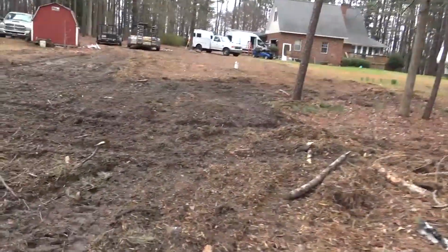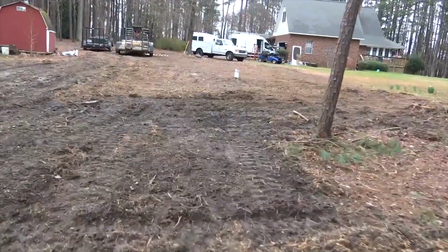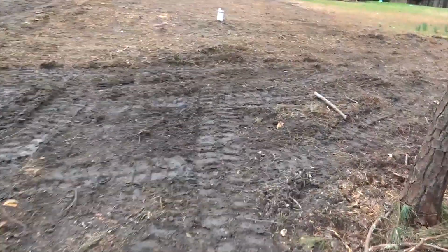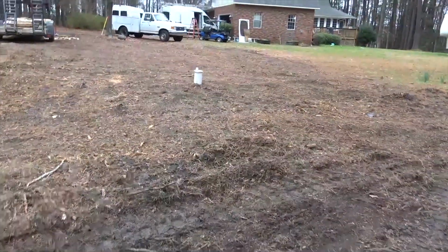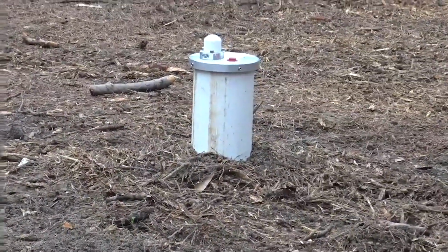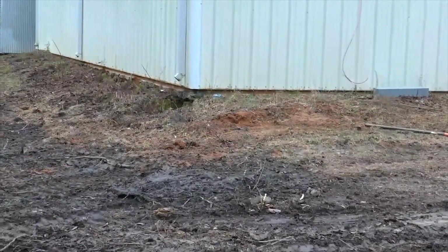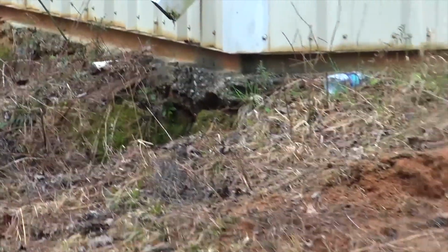Last night, I don't know if I mentioned it, the customer wanted his well fixed. Somebody had driven over the casing and broke it, so we dug down and cut it and added a bell and extended his well casing up so he can at a minimum put a hand pump in there. I gave him a cap where he could put a submersible indoor hand pump, and we're going to trench in a water line. He has a bathroom in this corner here stubbed in, some drainage and things, so we're going to bring water to that area as well.